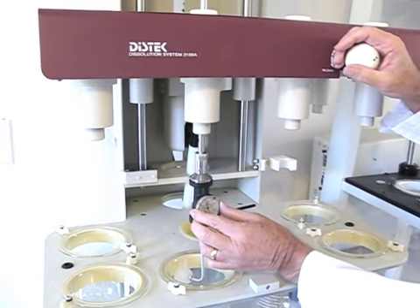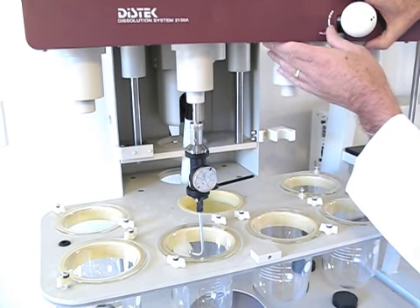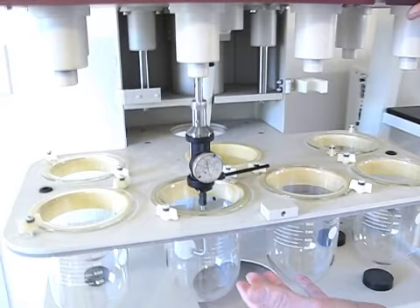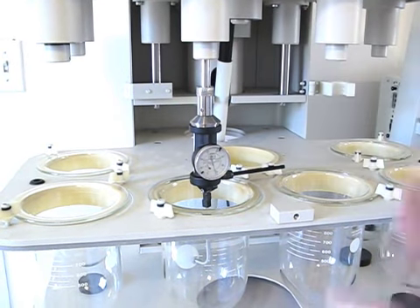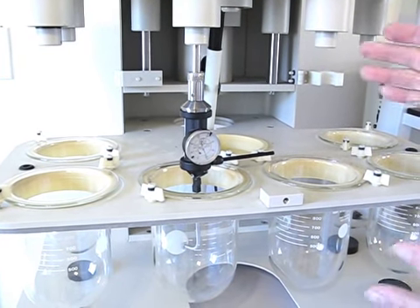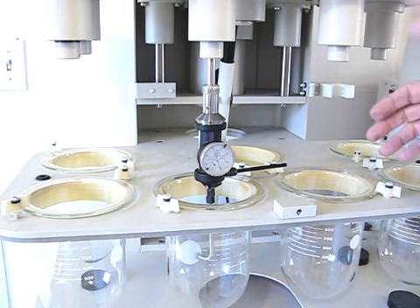We can start by looking at tilt. I'm going to zero the gauge — we can zero it onto the 40, and that gives me a clean starting point. Now I'm up at the top of the vessel; I'm going to lower it down to about where the paddle operates, which is close to the radius, and observe how far the gauge moved during that travel. A lot of people look at tilt of the shaft and vessel levelness, but the relationship of the spindle to the vessel is what's most important, and this is actually measuring tilt in that regard. I'd allow up to half a millimeter — the baths are generally very good. We only moved about 0.05 millimeters, so this bath is very good.